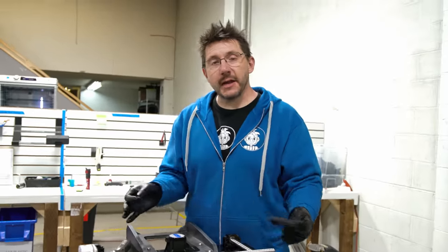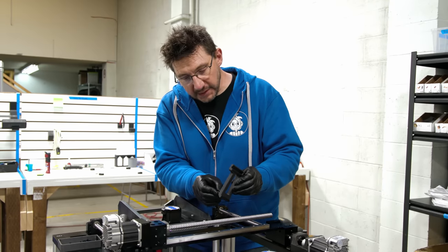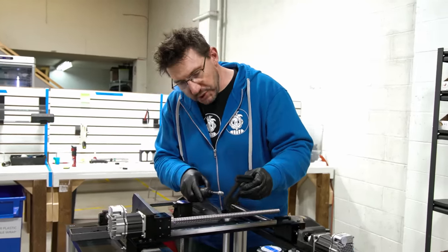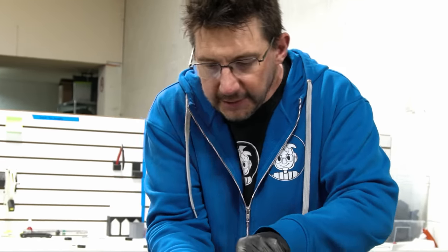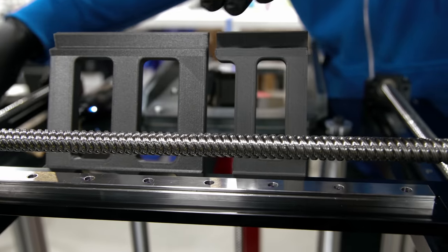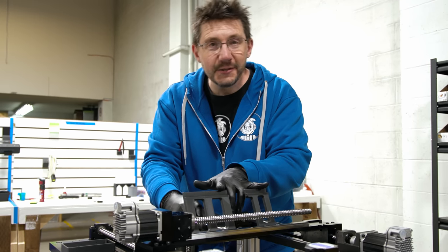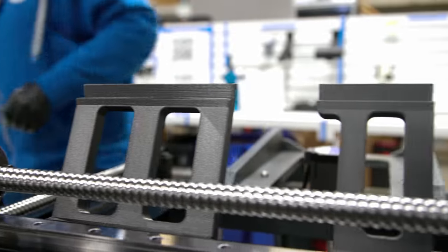At this point in the process, we have to add some more parts, and they happen to be 3D printed. 25% of the bill of materials of the HS3 is 3D printed. And in fact, Pantheon has a farm of three HS3 machines that do all of the printing for the parts on the machine. The materials that they're using on the farm for all of the prints on the HS3 is carbon fiber nylon and carbon fiber PETG. The printed parts on this machine aren't a part of the motion system or the things that keep it stable. The 3D printed parts actually help support the motion system. As an example, these parts hold the cable chain. As I'm installing this piece, have a look at the print quality. It's extraordinary.